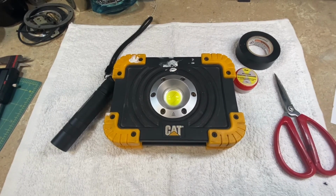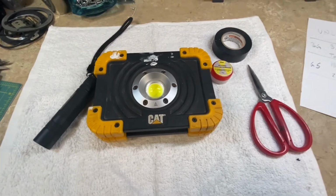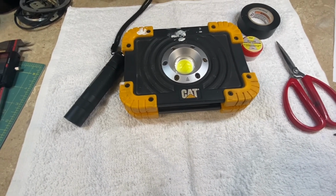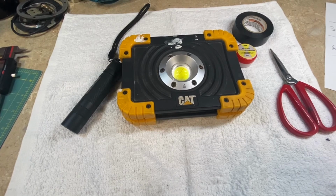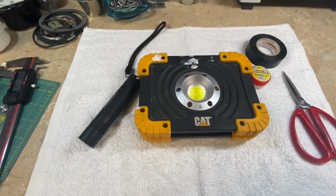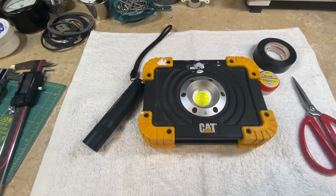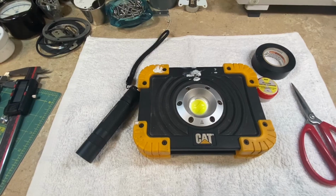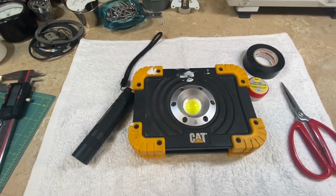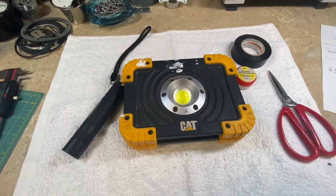So again, my conclusion on this is that for amateur, and I stress amateur, gamma spectroscopy, there is no reason to let your PMT and your crystal stabilize or just sit around in the dark for hours and hours and days or weeks. For what we do as amateurs, looking at radium and cesium and bismuth and different things like that, there's literally no reason you couldn't just immediately plug this thing in and go to work. It's not going to damage your PMT assembly, and you can automatically start using it. That's my opinion based upon what you've just seen.